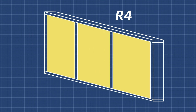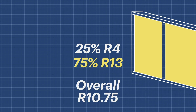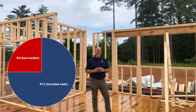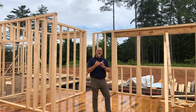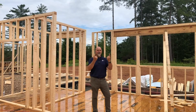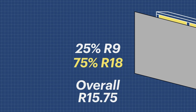Code says we have to insulate the walls to at least R-13. That means in a stick frame or wood frame home, with 25% of the outside walls being wood, we're only insulating 75% of the exterior to R-13. What we do is wrap the outside in foam board — that is an R-5. We've roughly doubled the resistance to heat flow on the exterior for 25% of the outside walls, and added another R-5 to the 75% of the walls that were insulated to R-13.